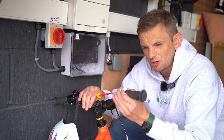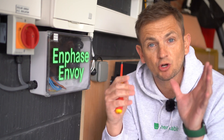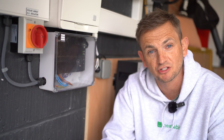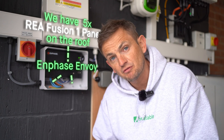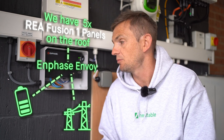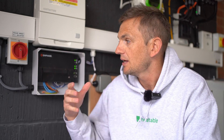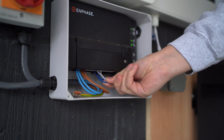Now let's look at our Enphase system. We used the Enphase Envoy to monitor the system, paired with the Enphase IQ7 Plus microinverters. The Envoy is the brains of Enphase — if you have Enphase microinverters, all that hardware is up on the roof and all you need down below is one of these. It's a communication gateway between your microinverters and the Enphase Enlighten app, and it makes installation super simple because all that comes off the roof is one AC cable.